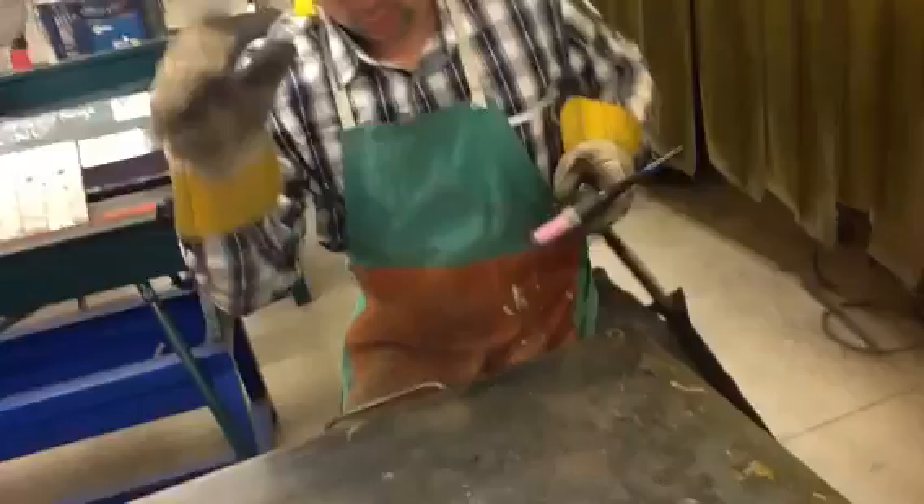Let's try it again. Ready? Cover. I'm dialing this up right now, watching for the metal to melt on the base and the top. I know the base is going to take more heat, so I'm keeping it down there right now. I'm still dialing up. Now I've got a little weld puddle forming there, a little bit of molten metal. I'm going to go up to the top and grab — there, they just melted together. Now I'm just moving down the line, moving that tungsten tip back and forth a little bit. I'm going to get them to come together. And I'm actually dragging my hand on the cable as a guide.